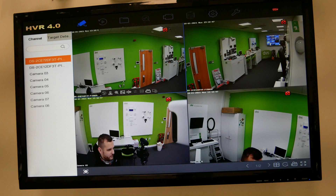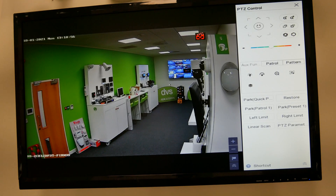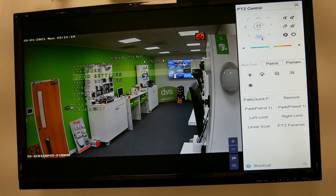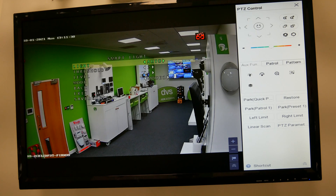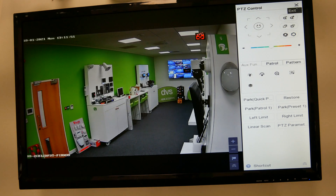Once you're happy, go back to the live view. Another handy tip: bring up one of the cameras in the PTZ control. You can either call preset 95 — the old-school way of calling the camera OSD — or press the menu button. On pressing the menu button, adjust the video format — already set to 2 megapixel 25 frames per second. Adjust exposure using the iris open function to navigate each menu with left and right settings. Go to audio settings, set audio on, and volume is six but you can turn it up to nine. Then go to smart light settings, adjust as required, and save and exit.